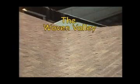First, we'll look at the woven valley. This is the weakest valley and should only be used with 3-tab shingles. This technique should not be used with GAF-ELK laminated shingles because of their thickness. So we'll install a woven valley with 3-tab shingles. Remember, valleys are a prime leak area, so it's important to be extra careful.